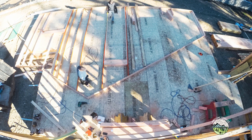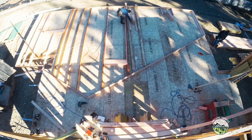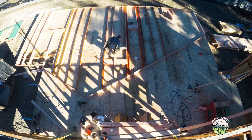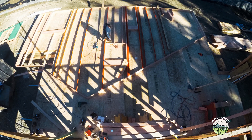In this case I ordered 26-foot LSL material from LP because we wanted to go two stories plus the gable and double up the kings. It's very dense material — I really don't like it — but it's dead straight and it helps keep that wall nice and flat as well as stiff when we lift it.